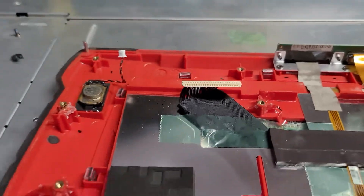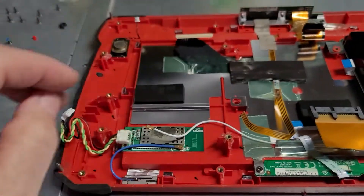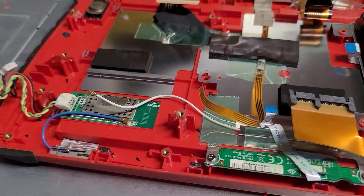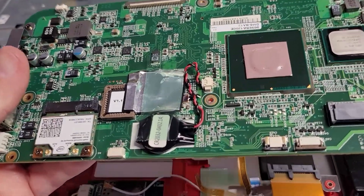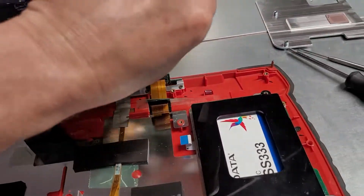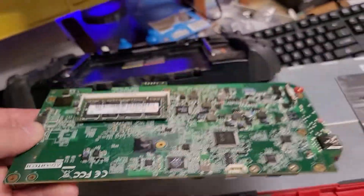I even had another one snap off here. The problem that happened to this Snap-on unit is it was impacted on this corner — the shearing effect comes from here — and these units began to shear off. Now there's a real serious problem with this, because when you look at the actual logic board — this is the logic board — it is also very fragile. It's not designed to take an impact like this. One of the key details I've discovered is that the motherboard RAM is very prone to damage. Why? Because these brass fitters were floating around inside this chassis making contact with that logic board.